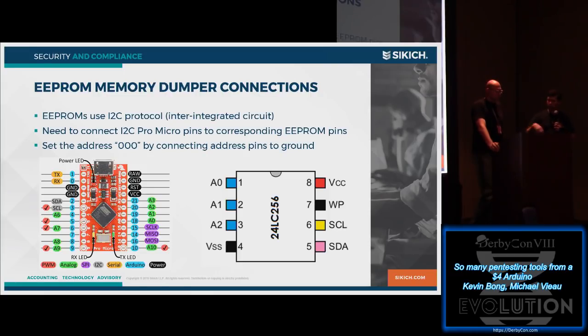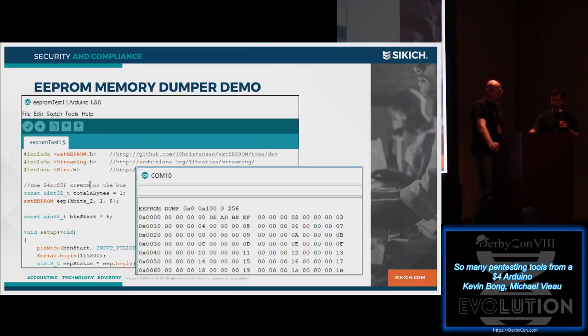And if we look over at the data sheet for the Pro Micro on the left-hand side, we see that I2C is the gray box, and so they're showing SDA is pin 2 and SCL is pin 3, and ground and voltage would be as you'd expect. So you just line up and connect together that way.